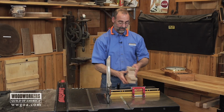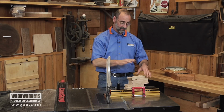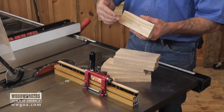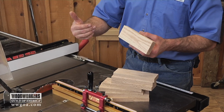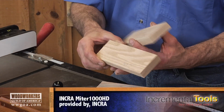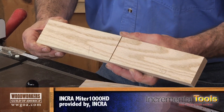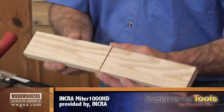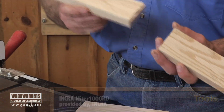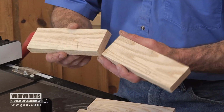My preferred way to make this is to start with one long piece. So I've got one piece, in this case of oak, that is long enough to make all 8 pieces that I want for the clock face. Now notice that my parts are lettered. What that tells me is the sequence in which they were cut. So see how the grain comes back together on those. I'm going to pay attention to that as I cut my angles and then later as I assemble my parts so that I get some amount of grain flow through them.